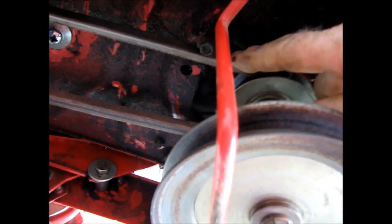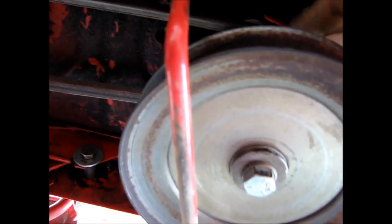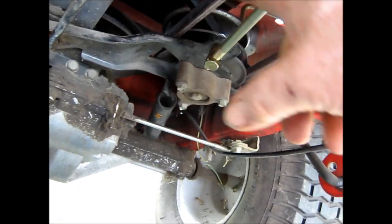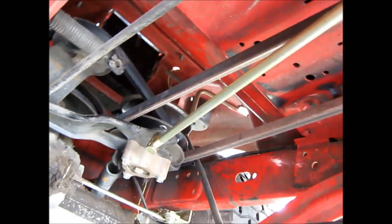One more thing while we're under here — just in case you didn't know how the layout is: this is the belt that runs back to the variable speed pulley. It's got a couple of little guides right here, one on each side, and you have to let the pulley down or bend these things out to get the belt on there. The belt runs back through here, very basic, and then it goes into the lower part. It goes from here back, around that one, and the top belt is small when it goes on the top half of that variable pulley, and it goes to your differential back there. Just in case anybody needed to see what it looks like underneath — this is a basic picture of the drive belt system.